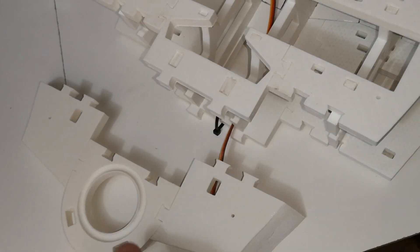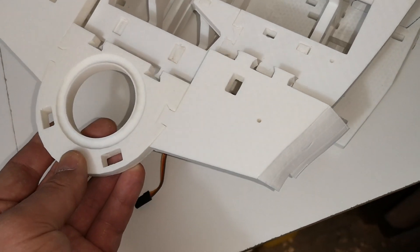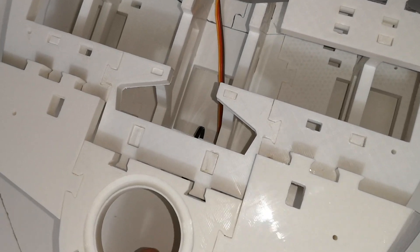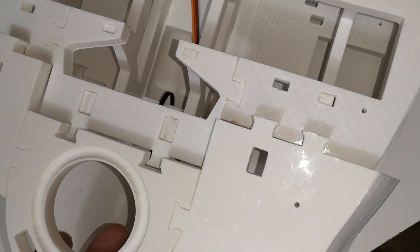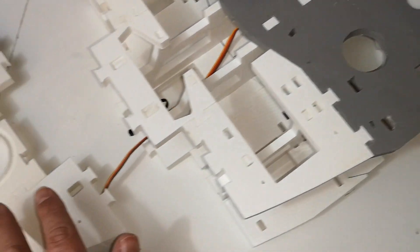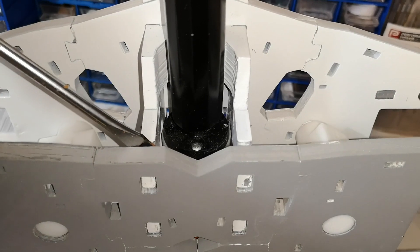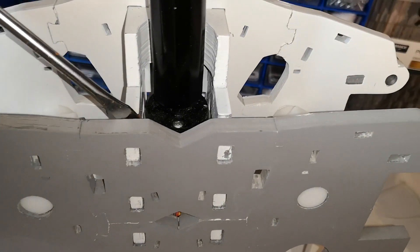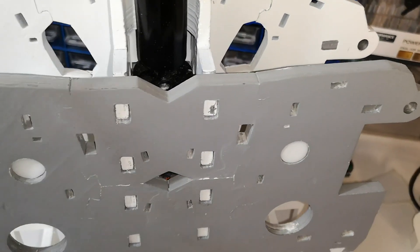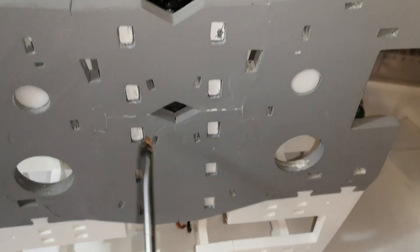So we can actually see now how this is going to attach to the torso. This part here is the front of the stomach assembly and that needs to slot in there like a jigsaw puzzle. I'm sure I'm going to have to do a bit of work on those dovetail joints, so I think that'll be the first thing I do as the reassembly starts. I'll just remove this front plate and then we can start getting this attached. Getting a flat blade screwdriver down here just behind the front plate and twisting it will prise the front plate off. I'll be a little bit careful as it seems a little tight on the centre ones. So that's removed.